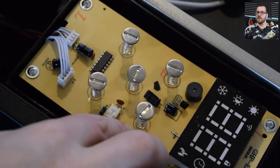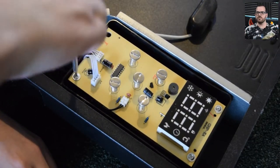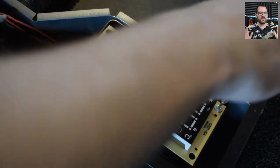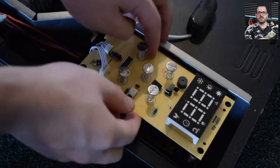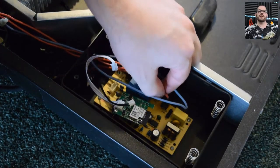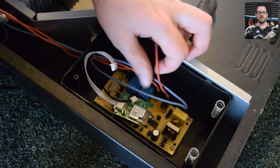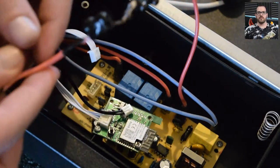The front panel itself seems to be spring-loaded — I'm not entirely sure why, possibly some sort of vibration reduction mechanism, especially as the buttons themselves are also spring-loaded and contact the glass. I removed the screws to get to the power supply underneath. There's a two-pin connector for the thermistor at the bottom of the radiator, which senses the room temperature — it pops out into the world as an external probe — and there's another connector that connects to the board below. You can also see the Wi-Fi module just stuck on top of the control panel.